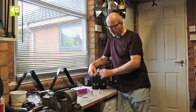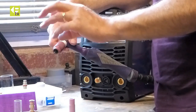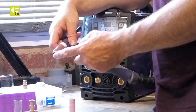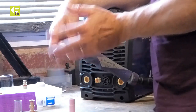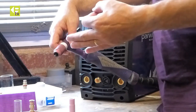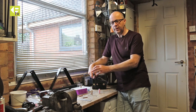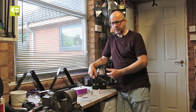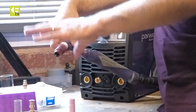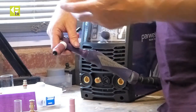The big advantage of the gas lens is it's much better at giving you that laminar flow. You can run with longer tungsten projections from the front of the torch, and it's more resistant to drafts affecting the gas coverage. So if weld quality is your prime concern and ensuring you've got a really good gas envelope while you're welding, the gas lens is the solution. This is a standard one — you can also get large series and extra large series gas lenses to extend the area of coverage if you're welding with more sensitive materials.